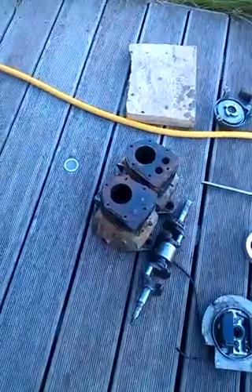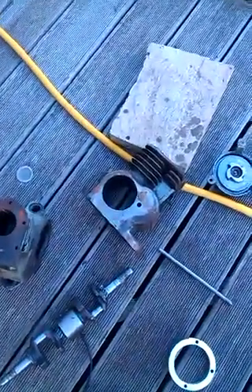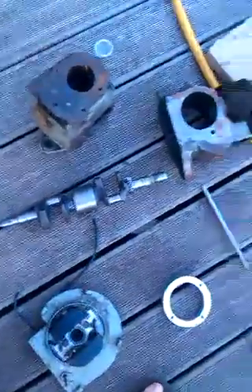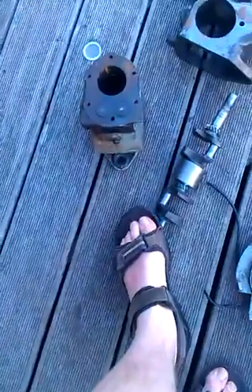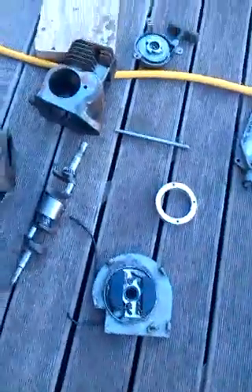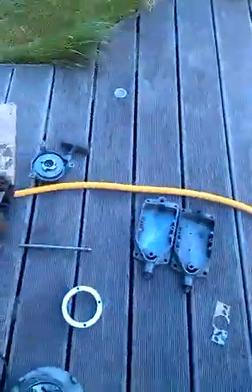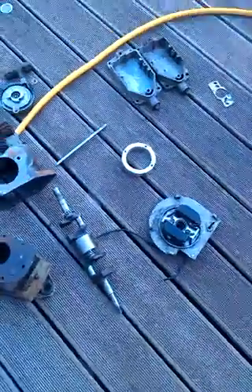That's all the progress at the moment. The next job is to drill the holes in the front block to mount it all and bolt the crank cases together. Unfortunately I've made a bit of an error with the crank length — it was supposed to be about 0.2mm too long to allow space for gaskets, but somehow it's ended up almost 2mm too long, so I'll just have to take a little bit off the front on the lathe — no big issue. After that most of the machining is done and I can start looking at building a base. It'll probably be a couple of months because money is a bit tight, but maybe a little while before it actually runs. Thanks for watching.